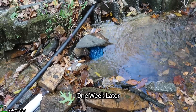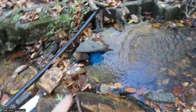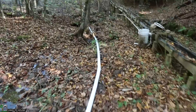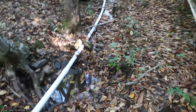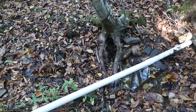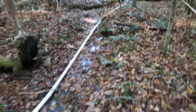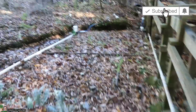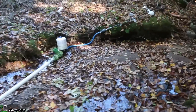I've extended the drive pipe by 40 feet, giving about two more feet of drop. Here's the new intake — it's going to skirt along here. You can see where the old intake was, right here. Now there's a lot less water because the flood we were having has passed. Hopefully the water we have up there is enough to run this pump now with somewhere around five or six feet of drop.